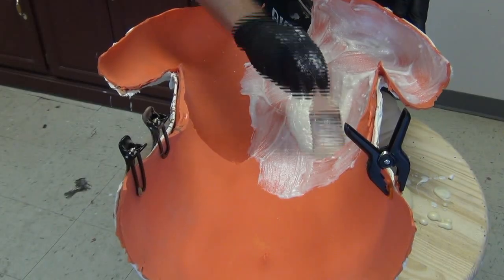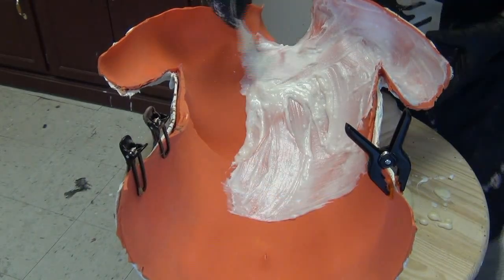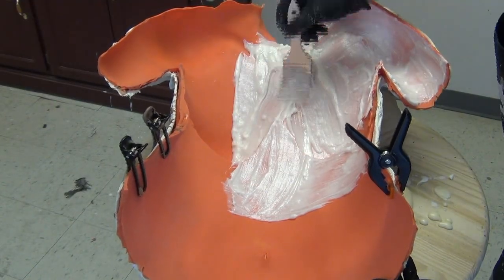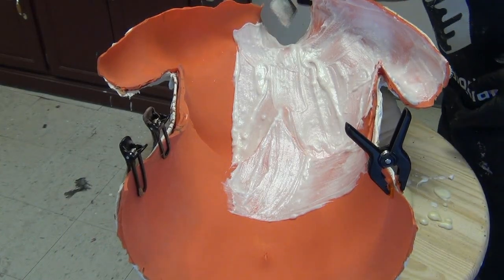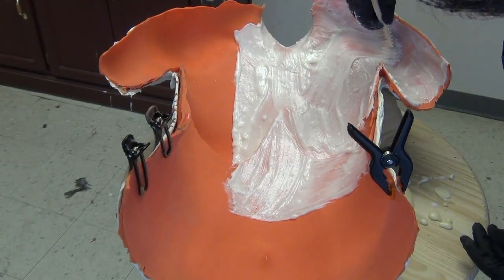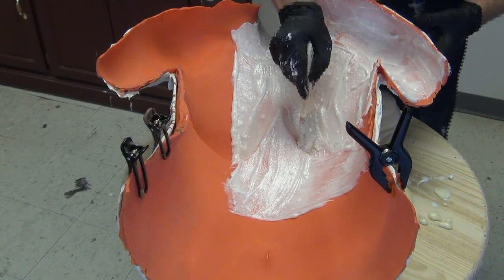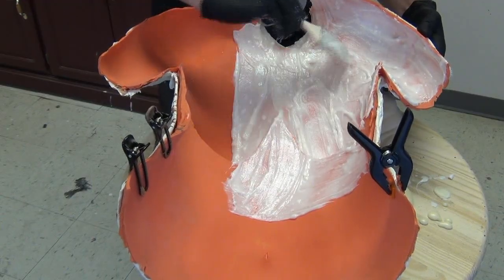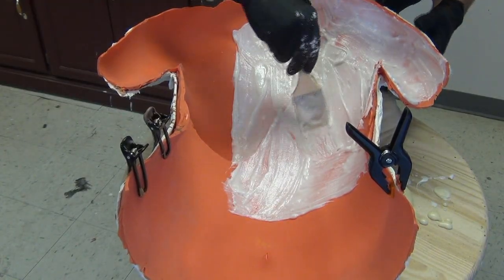Because this is a paste consistency, I'm not worried about dumping it in the mold and having it spill out everywhere. You can kind of scrub that resin into the mold to make sure you capture the surface detail really well. One of the reasons I'm using TC808 versus a slower-setting material is that TC808 is very moisture resistant, so it's excellent for these kinds of applications where I don't want to risk any moisture contamination from ambient humidity or anything in the mold — just a lot easier to use with a lot more consistent results.